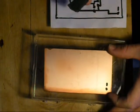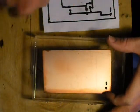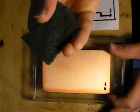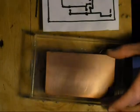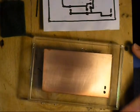You're going to want to take your copper board before transferring your image and give it a light scrubbing with the SOS pad to make sure there's no debris, buildup, or tarnish on top of the copper sheet, so that your etching solution will penetrate and remove all the copper you desire. When you're done, you should get a nice shiny copper penny look to it. Once that's done, you can start drawing out your image, and that way you won't have any areas that fail to remove during etching.